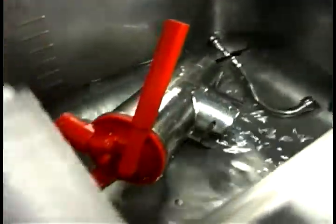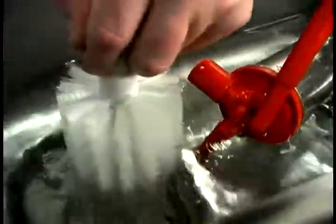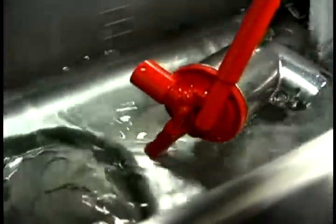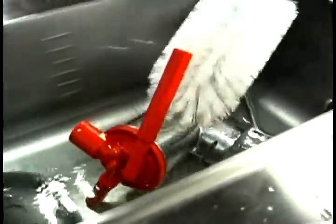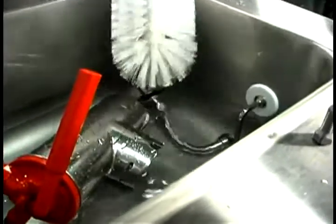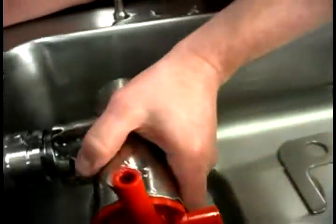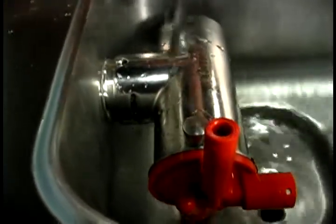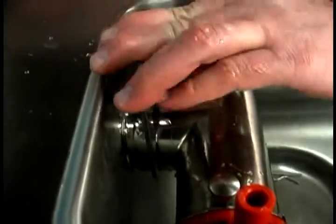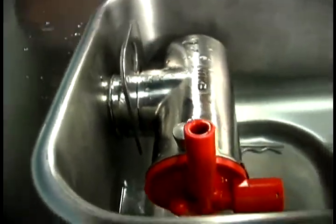Make sure your hands are cleaned and sanitized, then brush clean the mix level sensing probe on the front wall and the bottom of the hopper, the mix hopper, the mix inlet hole, the air mix pump, the pump clip, the mix feed tube, and the locking clip. To position the pump on the drive hub at the rear of the mix hopper, align the drive hole in the piston with the drive crank of the drive shaft. Secure the pump in place by slipping the pump clip over the collar of the pump.